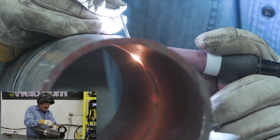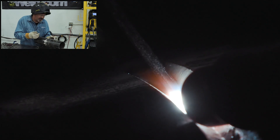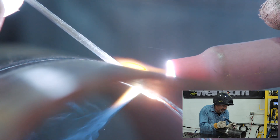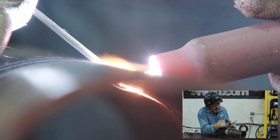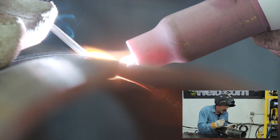Being right here in position where you're not uncomfortable — so you could hold the torch differently. Since I said I was walking the cup in there, I could do this by resting the heel of my hand in here, freehanding it. A flex neck torch allows me to get right in there. I'm going to come up to a tack. I kind of like to heat everything up, dab some wire in there, wash back across, and blend it all together.